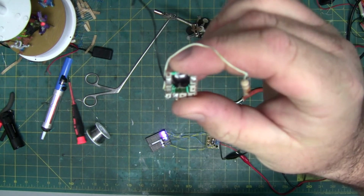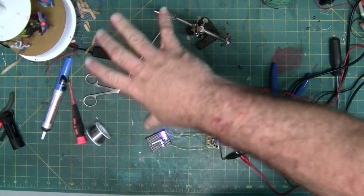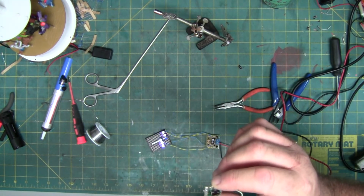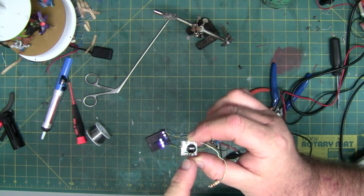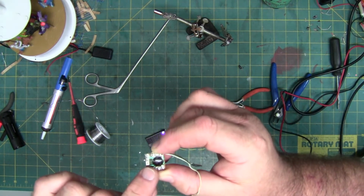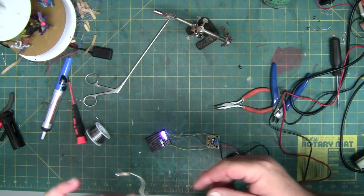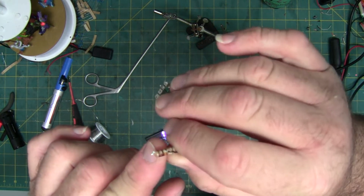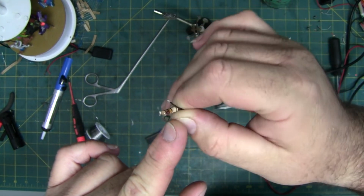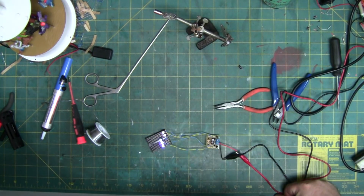That's it. What else it did, because every video I've seen, all the external lights are solid or they're not on. So I'm not sure if this makes them flash slowly or not, but this doesn't work anymore. You send power to it, nothing lights up and no outgoing, so the little chip that's inside here has burned out. They still have good continuity on the one resistor on the back, and this is one of the resistors that's getting replaced because it's still good, it still registers good, but you can see it's discolored from the resistor next to it burning. And I'll show you that one.